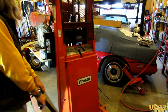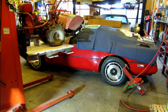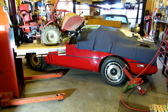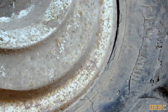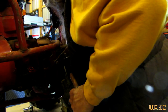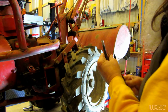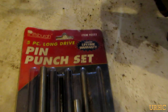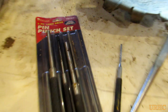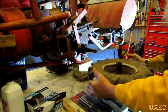With the tines changed over, I put a little bit of PB Blaster in that spring to make it easier, then swung it around to get at the other side. This is the side with a tire that just won't hold air anymore — it's got some really bad cracking and splitting in it. There are some tears but nothing goes right through to the inside, so I figured I'd try a seven-dollar tube instead of buying a forty-dollar tire. I got the wheel and tire off — there's a roll pin that you have to sneak in behind the wheel and tap out. Having a set of pin punches from Harbor Freight — about three dollars — is really handy for getting these pins out.